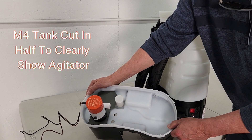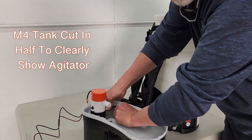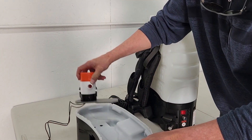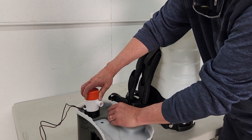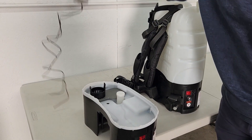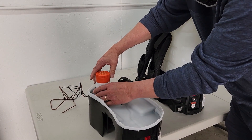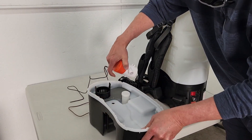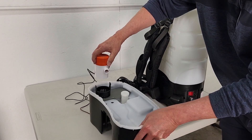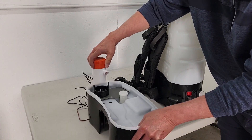This is how the agitator mounts inside the tank. It's got a mount plate, and we'll show you how that mounts. It comes in like that and rotates. When you install it, you can't do it that way — you come in from the top of the tank, push this over the ears, and you're in business. You can also change the orientation based on the holes and the cable tie that's used.